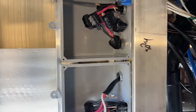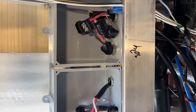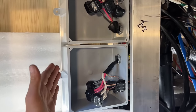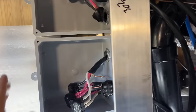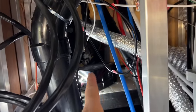Andrew just finished up making the AC connections for the inverters. We ended up going with an eight-by-eight box — two of them — as well as these little Morris connectors, and I think it turned out really, really good. This bottom box is the AC in — you can see my watchdog right there. The shore power plug on the wall connects to the watchdog, and the watchdog then comes into the top of this bottom box.